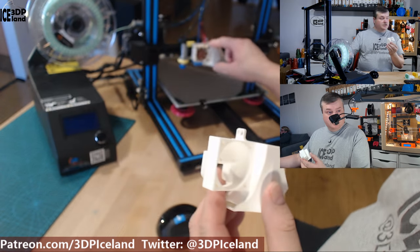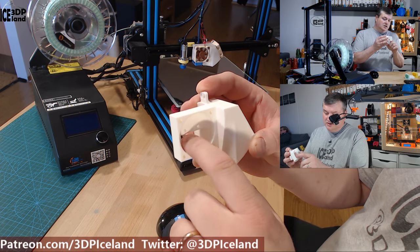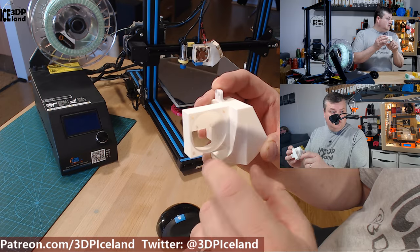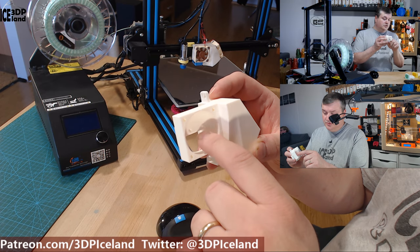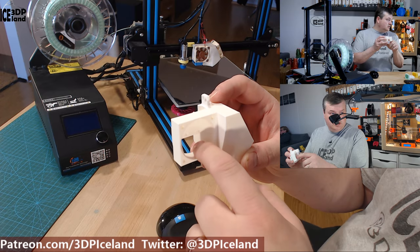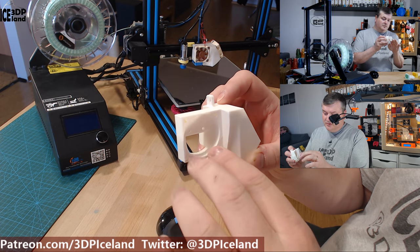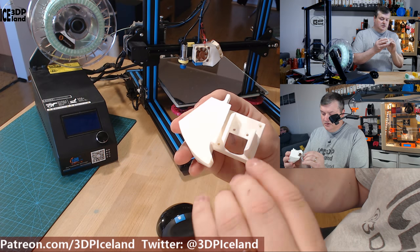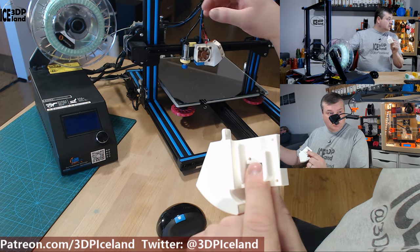I designed a mount in Fusion 360 and I'm going to show you the mount and how I did it. So this is the mount here on my printer with the two Noctua fans. This is the place where the hotend fan is mounted, and this hole here is where the airflow goes to the cooler part of the hotend. This part here is just the coupler for the bottom tube, so there's no need for air in this area — only the smaller area blows air to the hotend cooling part. It mounts with these two holes on the CR-10 bracket for the X-carriage with two screws.